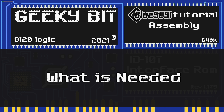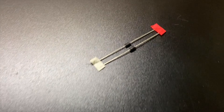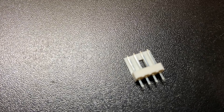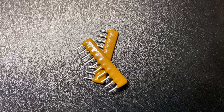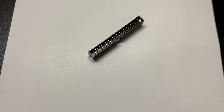Now let's talk about the parts you'll need. You should either have these in a kit you've ordered or as parts you've ordered to assemble your own. First we have the PCBs. Next we have the SD card slot — you will only get one but this is a multi-pack package. Next we have the diodes and the jumpers and pins. Here's your power connector, here's your 330 resistor pack, here's your 220 resistor pack, here's your blue pill, and here's a 50-pin SCSI connector.